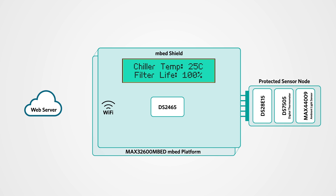We'll request a challenge from the web server. We use this to prevent replay attacks where old data would be reused by an attacker. Once we have our challenge, we'll put that data along with our sensor data back into the DS2465, and when that's combined with a secret shared between the controller and the web server, we're able to generate our MAC. The secret is always stored in the DS2465 secure memory and never leaves. Once we have all of our data, we can send that up through our Wi-Fi connection and the web server is able to validate our signature and ensure that the data came from an authentic controller, and can also verify that no errors were introduced and no tampering occurred with the sensor data.